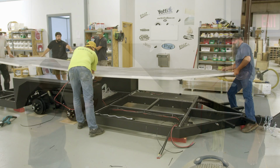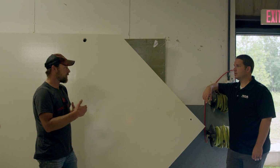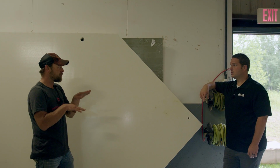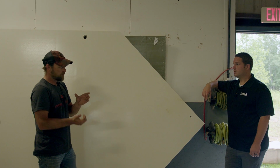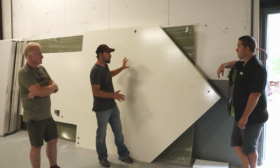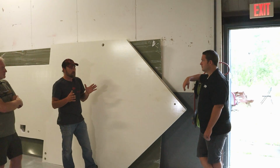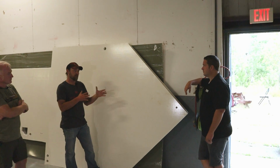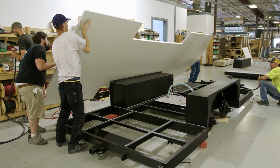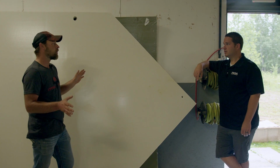Yeah, so a lot of campers have to have their cross members specifically located to match up with the seams. And whenever there's a seam, you can have different elevations, and it's a place for cold transfer to come through. This here is one complete single piece, so we've got zero cold transfer. And then the biggest thing that people aren't going to realize is that it allows us to put holding tanks where we want to put them. It allows us to design the strongest chassis with no limitations.